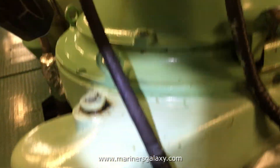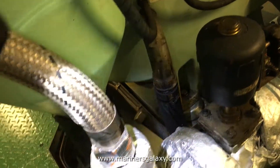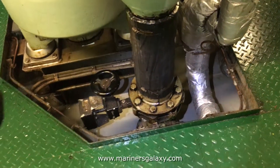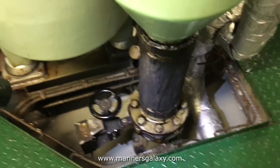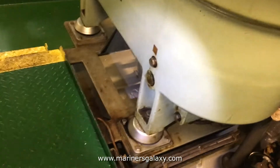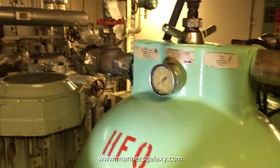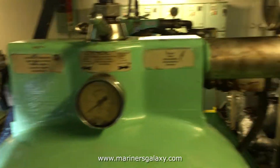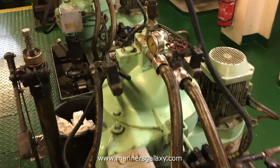You have two outlets for the dirty water and oil — one is the lower one and this is the major one when the purifier desludges. It has a butterfly valve connected with a safety switch, so if the valve is closed you cannot start the purifier — it's a safety installation. Here you can see the crankcase oil in the transparent glass. Here comes the back pressure gauge and this is the back pressure control valve; on this purifier we keep it at around two bars.